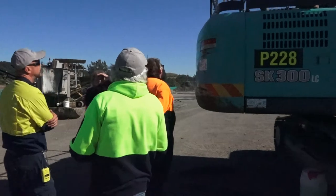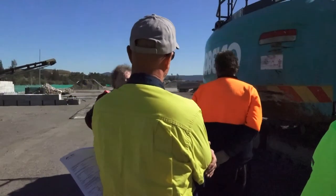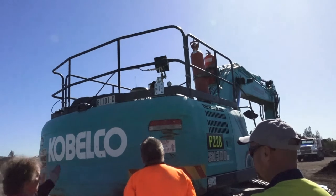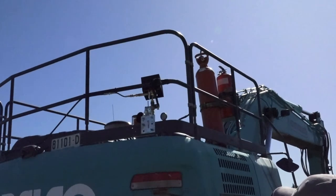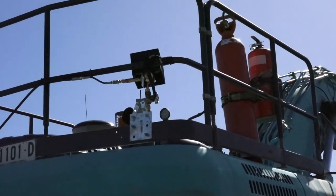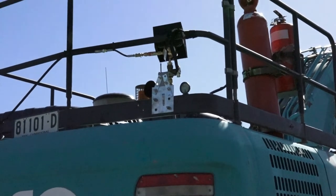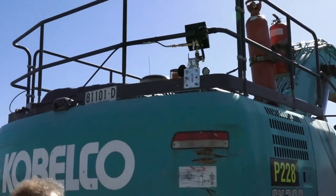It's coming down off the regulator. We have a flame arrester. So if there was a spark in the engine, the flame cannot come back up the line to the cylinder. It's a one-way valve, a safety mechanism so the flame cannot come back to the regulator and the cylinder. With oxyacetylene we get that checked every 12 months and certified. Is that the same as those regulators? This one, the regulator's 5 years, and the flame arrestor's two, because it's a hydrogen-specific flame arrestor.